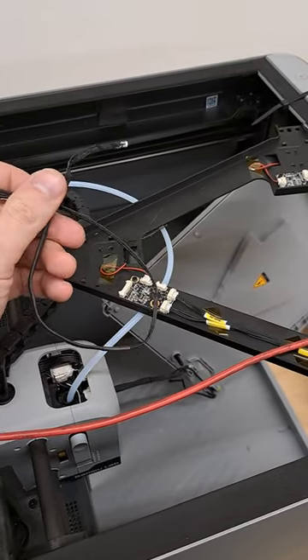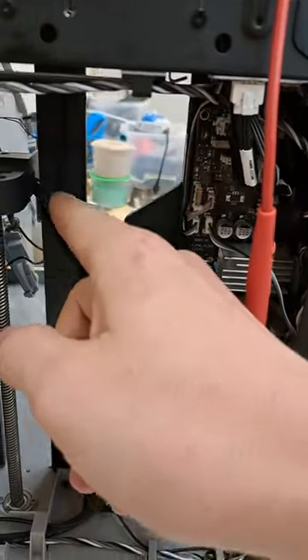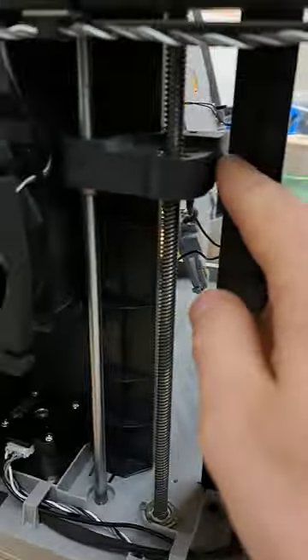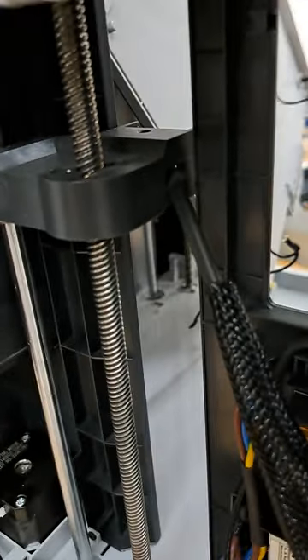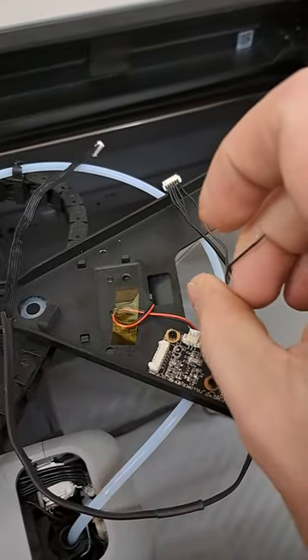This is the main sensor cable to the bed from the main board. It starts here, goes through this cable, through this very tiny hole with lots of sharp corners and a tight bend radius, and then up to this daughter board. I found mine broken about four inches away from the main board.